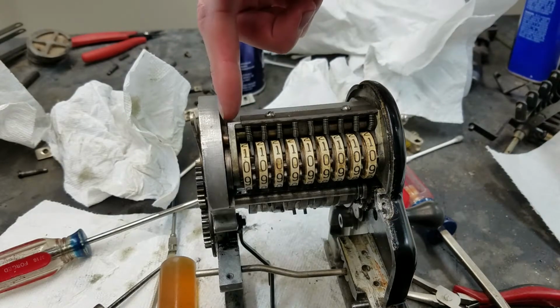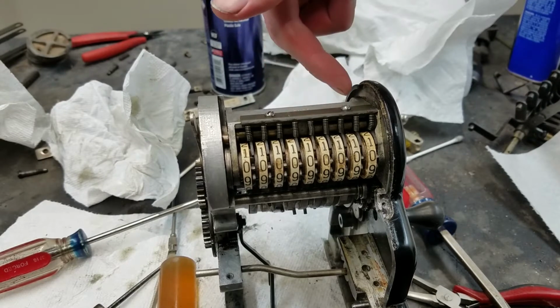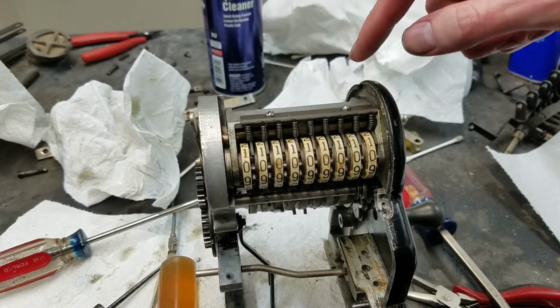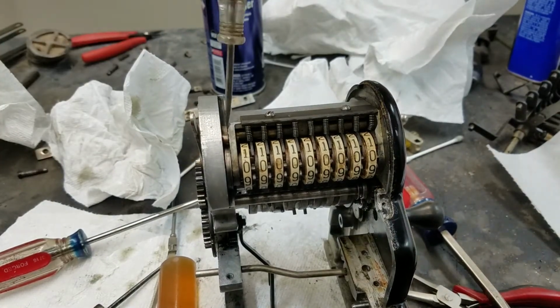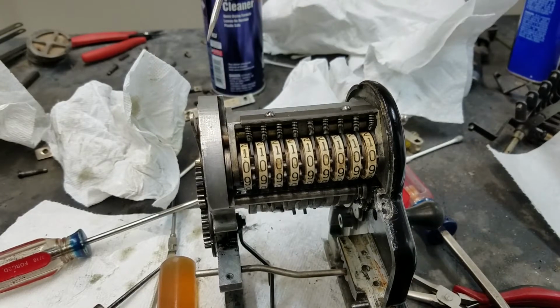Now, there's two screws that go into this side. There's one screw in the back here that holds this carriage assembly to this side, and there's a dowel pin that aligns it. This side has two screws and no dowel pins. So there's one big fat screw back here, and then another one that goes here, and then gets this little spacer, which, hoping that's the right spacer.